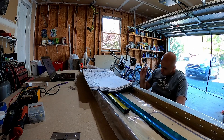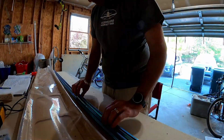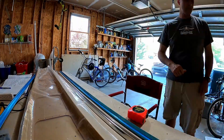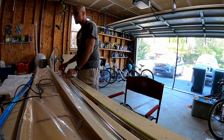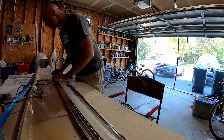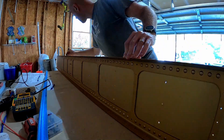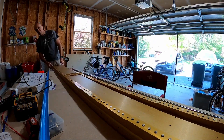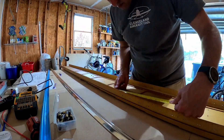We're using the holes in that spar to create some stiffener pieces to be used on the wing skins later on. They only give you a certain amount of that stiffener material — still covered in blue there — about six pieces that are 95.5 inches and four that are 72 inches. I just wanted to be sure that before I cut any of them to the needed lengths, I was going to use the right pieces so I wouldn't have to order more.